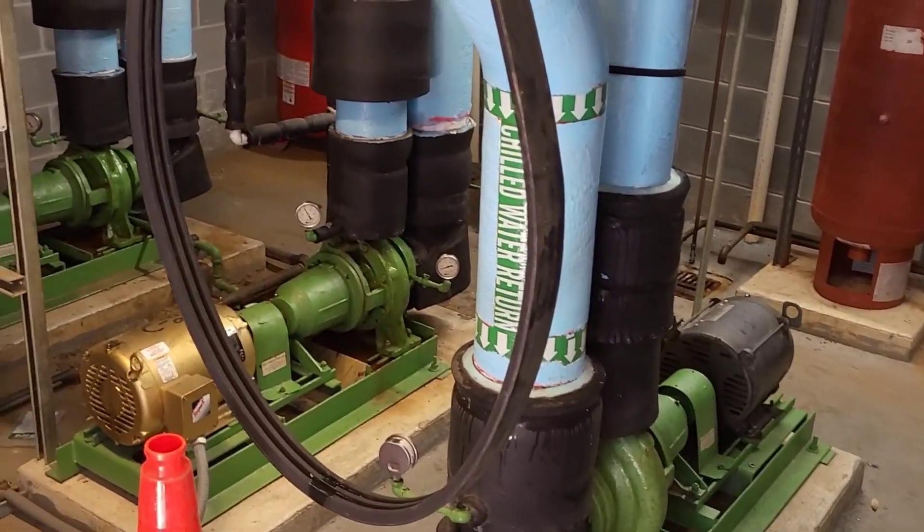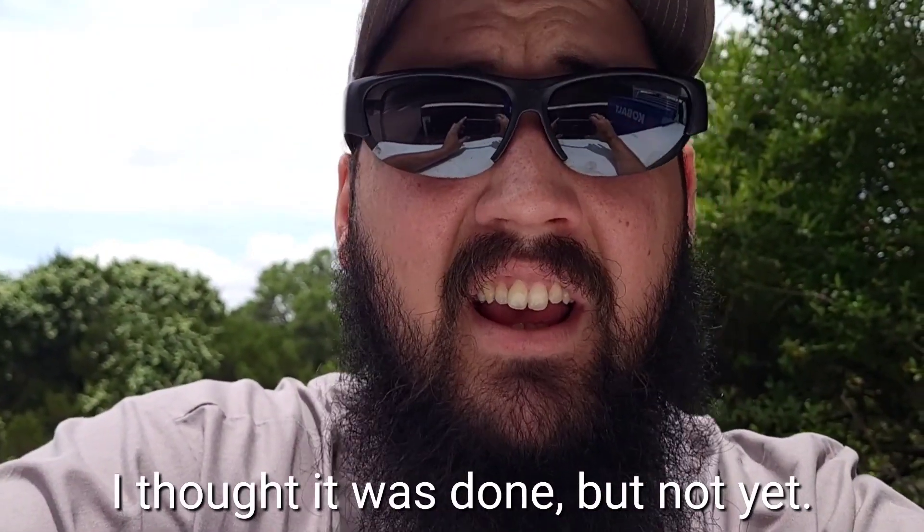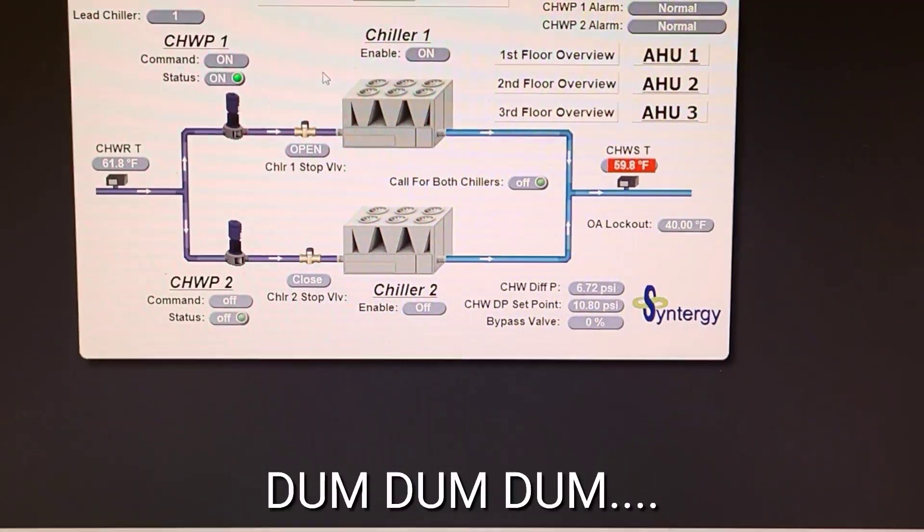We look good here at the pumps. Like I said, I'm pretty sure the issue was the set point on the chiller. The customer has elected to get a price on those relays — they're trying to save as much as they can. These chillers are done, on their way out, getting ready to be replaced, so the relay costs are really insignificant — not expensive — but they're just not wanting to spend money in this scenario. My experience is they'll trip every few days, maybe once or twice a week, and they'll have to come out and reset them until they decide to replace them or the chillers get replaced.